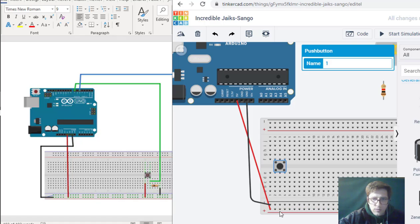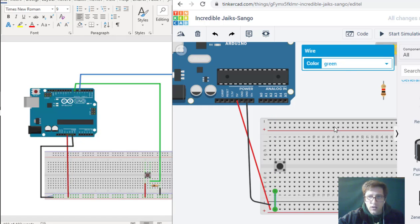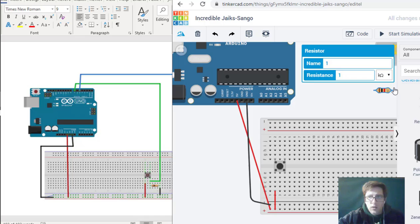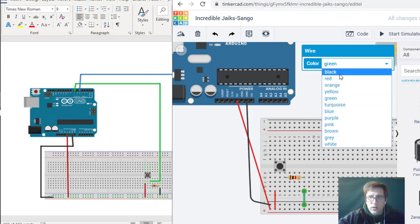Following the form again — it doesn't really matter where you place the button, but I'll put it in the second position for space. I'll go from red all the way up here; you could just tap it to the same line. Then we need our resistor — I'll rotate that. We go from the output of our toggle switch to ground, saving on wire.